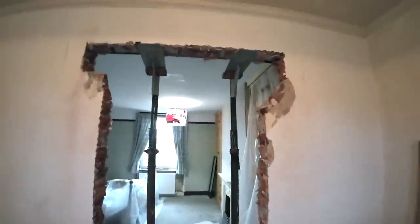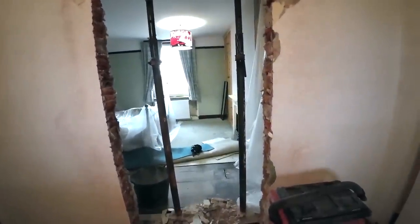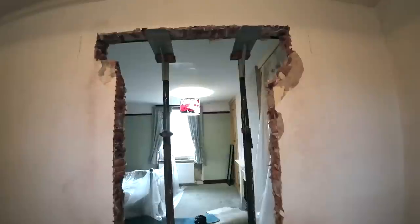There you go. Well, we got to 2:45. It's got to be a record, that. 2:45 before we hit a speed bump. Today's speed bump is, we got a 1200 lintel, to make sure it's big enough. We got a 1500 lintel because the opening's 940. We wouldn't have had 150 seating. So I said, get a 15. So we actually took the 12 out and swapped it.